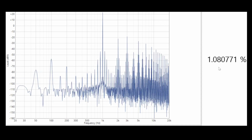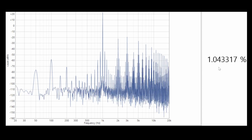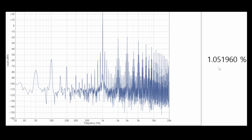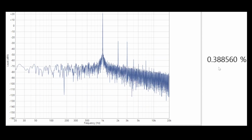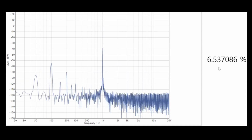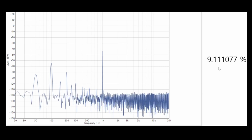As you look at the spectrum there, it's absolutely horrible. And it's not just the harmonics, the sidebands from that 100 Hertz is really dominant there. So hopefully that'll improve somewhat when we change our capacitors. But we're hoping that the other circuitry changes we make are also going to fix these noise levels that we saw. So let's take a look at what we're going to do.